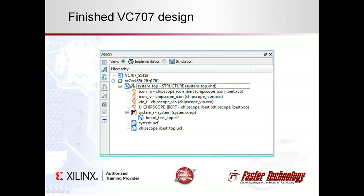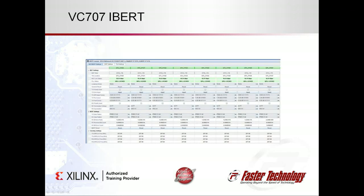We repeat these steps to port the reference design to the VC707, in this case modifying the iBert core to use more MGTs. Here we see all eight lanes running at 10 Gigabit Ethernet speeds. We have now seen the same reference design move from the ML605 to the KC705 and the VC707. We have seen that iBert allows us to quickly see the MGTs working in a real design and explore their parameters. The EDK subsystem demonstrates how to use software on an embedded processor to control the FMCs.